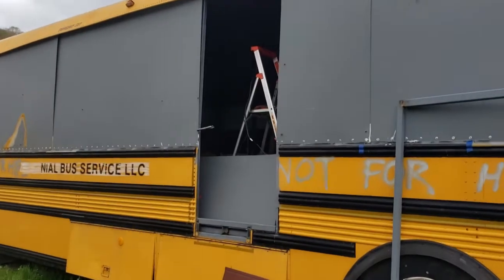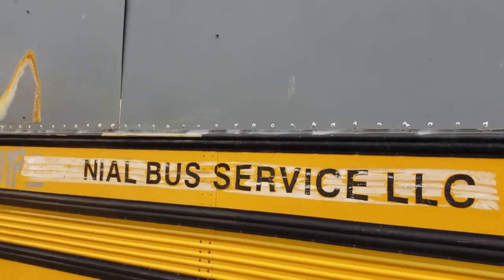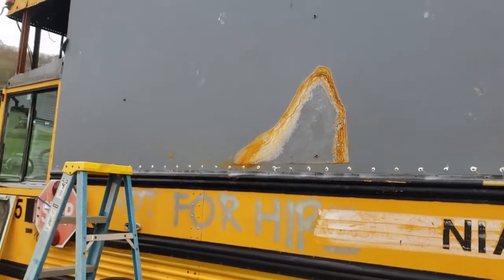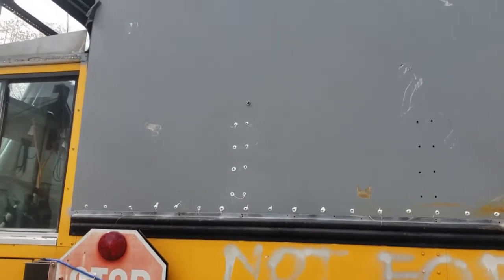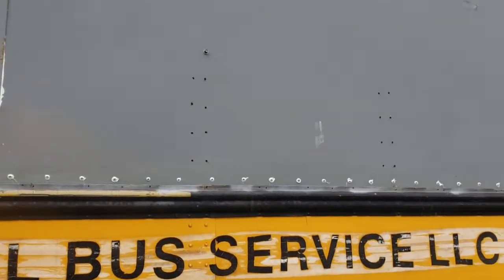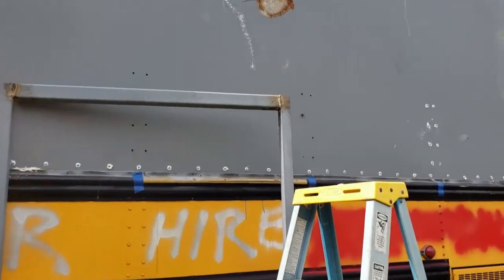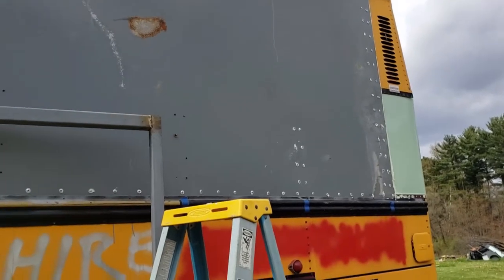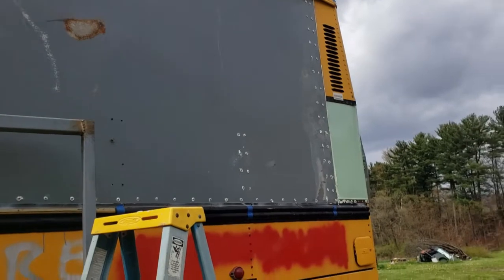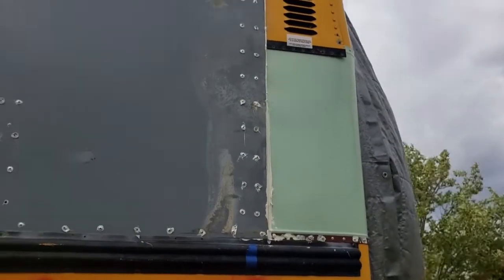Back at the bus. I'm going to start drilling the next layer of holes all the way down. I figure I'll do one or two rows of holes at a time and just crisscross the whole bus that way until it's up about halfway and stiff enough to do the top row — we'll do that with bolts again because that worked really well. I've got some rivets going up the sides of the wall, trying to get either end of each panel further up. Once they've gotten stiff enough from enough rivets, I'll be able to run the top bead and finish drilling the holes in the sides. Many, many rivets — it's a fairly slow process. I did manage to get this end all the way up because it's holding so much together. I used half-inch grip rivets.